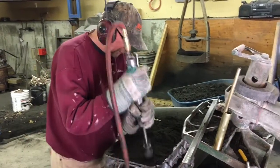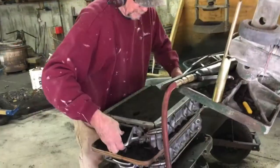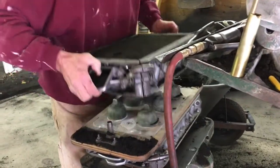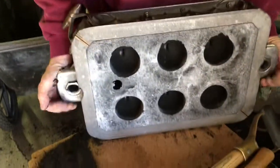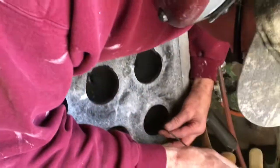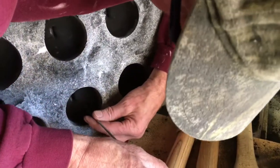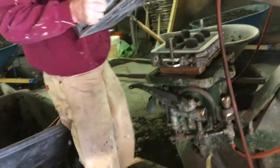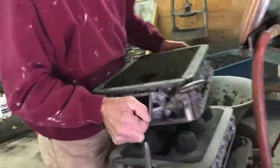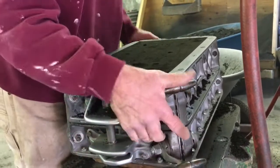Here Newman is finishing the mold that's going to be used for some of the small bells. Once it's packed firmly, he takes the top half away, and you can see the shape of the outside of the bells. He's putting in some vent holes, which makes the bronze fill the mold a little more easily. And there on the bottom, you can see the cores which fit neatly into the outer shape of the bell.